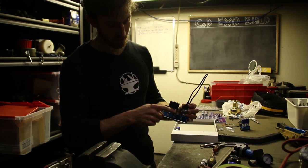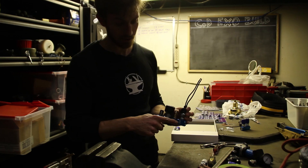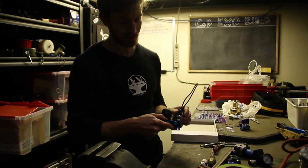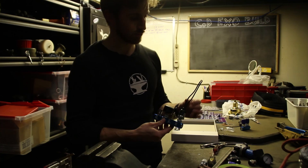This is the 235 psi blow-off valve — so if for some reason the compressor doesn't turn off once it hits 200 psi, this will go so the tank doesn't explode. Then we have our pressure shutoff switch, which will turn off at 200 psi and turn on at 165 psi, meaning the tank fills to 200 and won't turn back on until it drops under 165.